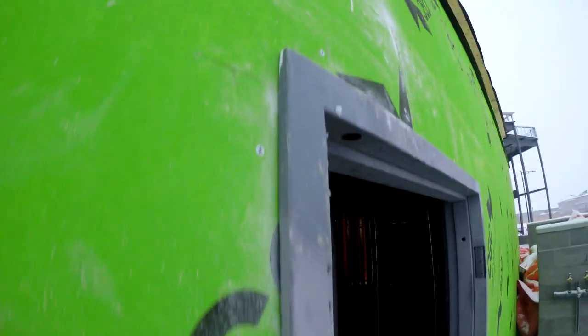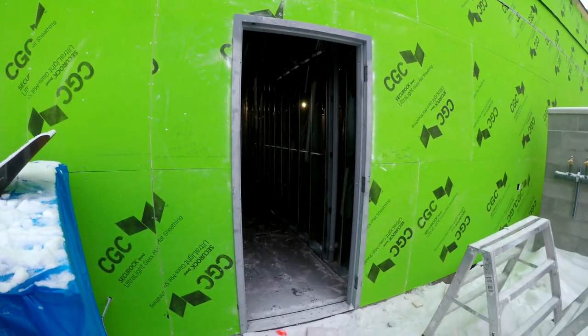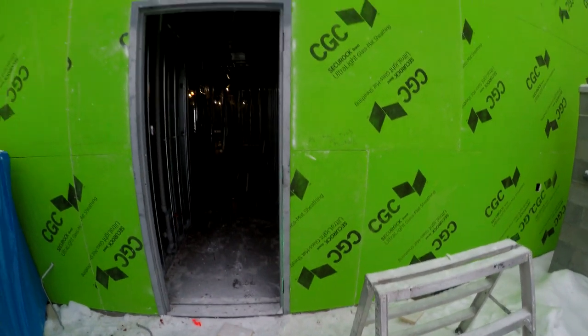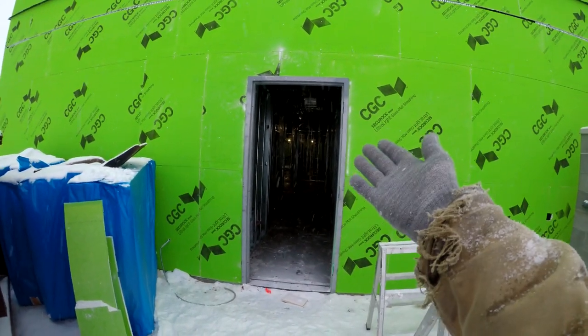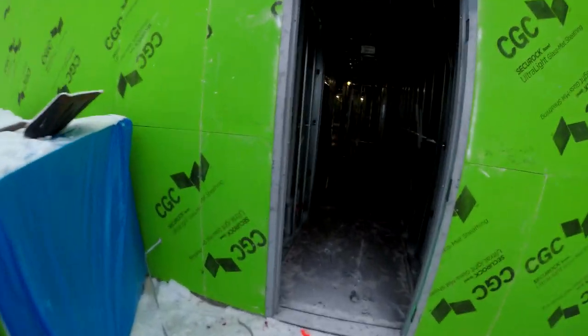Now it's time to put it all back together. Just so you guys know what it looks like when it's done and complete: the board goes in behind the frame all the way around, even on the top. You can see I just slightly cut where the clips are so it goes in. A trick is to 45-degree cut the back side of the board that goes into the door frame, and hammer in the wafers in the corners on the studs and the box beam. Always level the hinge side — make sure it stays level the whole time because when you're pushing the board in, sometimes you can move the frame out of square. The board goes in behind the frame all the way around, therefore it's fire rated. Also make sure your walls are level and plumb, because then your doors will be level — you only have to level the vertical side.